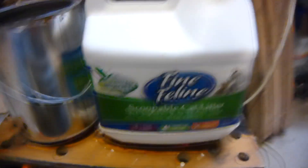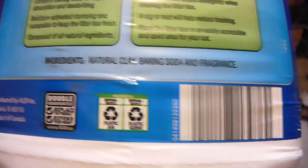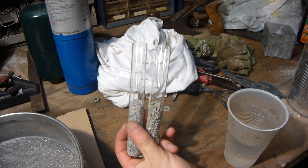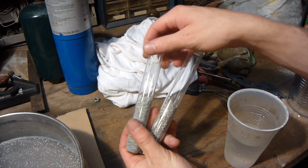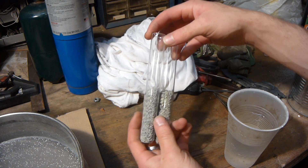The basic ingredients are kitty litter and sand — that's all you need. Bentonite clay is what you need. It says 'natural clay' on this one, but it is bentonite clay. I will show you how to verify that. So now we're going to figure out whether we have bentonite clay in the kitty litter. Here I have two different kitty litters — one of them is bentonite, one is not — and I will show you how to test for that.